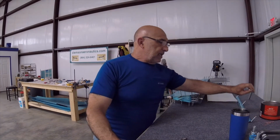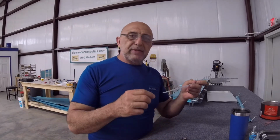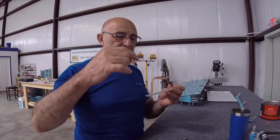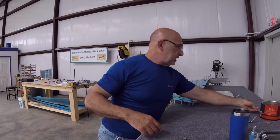But unfortunately, and I can foresee that coming, when I countersink that, I have to countersink it not for the rivet. I have to countersink it for the skin. So the skin will have a dimple, and that dimple would sink inside this. How I'm gonna do that? I don't know yet. I have to experiment with that. So you guys have to wait till I get the video out for the elevators, so you can see what the end of this experiment is going to be.